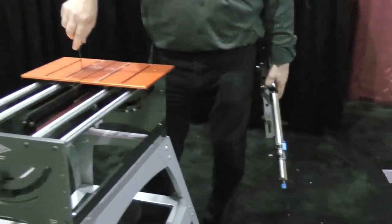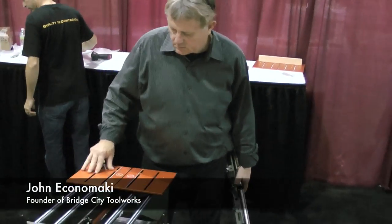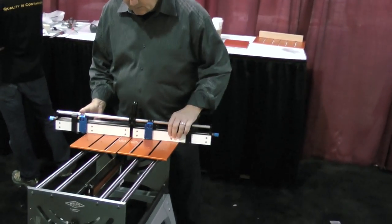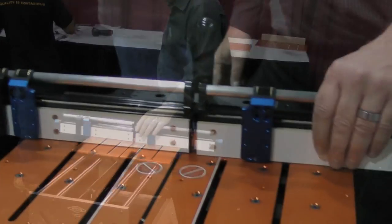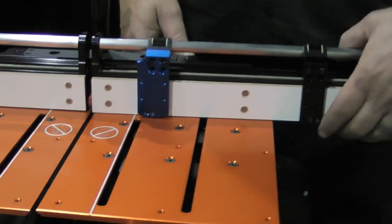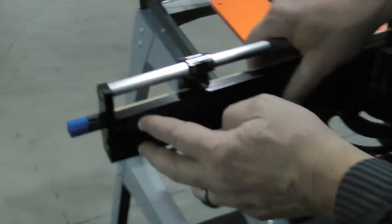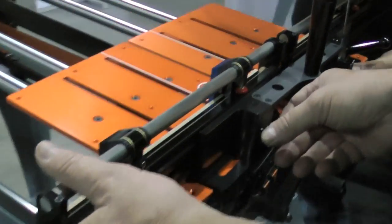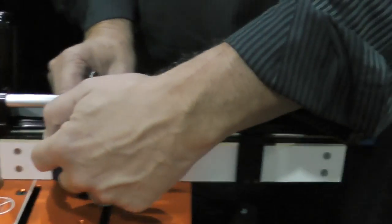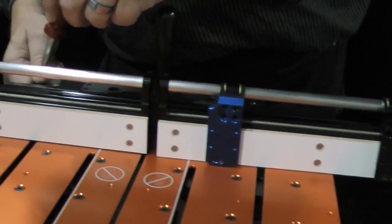It's sitting in his hand. The whole thing. Nice. So what were you saying about the slot on the inside that you did? Oh, so what happens is, see this extrusion here? Yeah. It runs on tracks. Okay. So what that does is it keeps our angularity from varying on this. Right, so we can correct here by using these screws, and then you can adjust, remove and put it back on, and it's correct. Doesn't require the calibration.